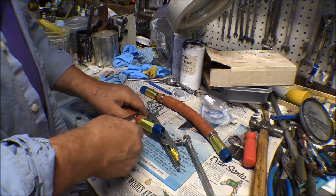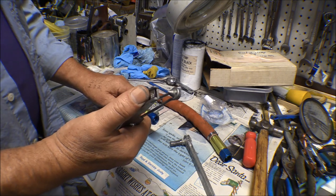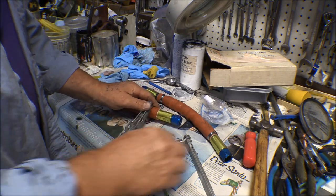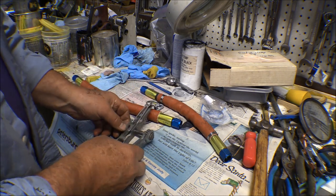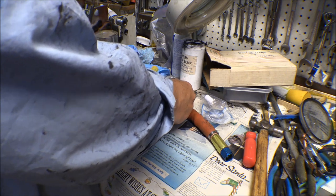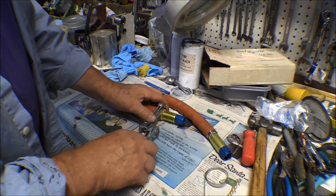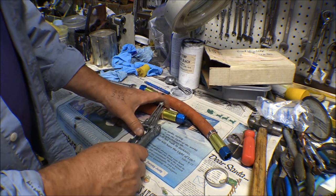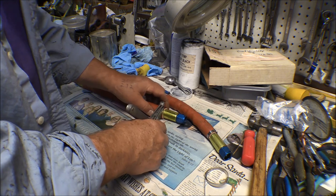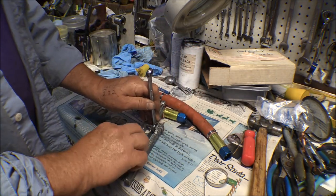It's kind of an all-purpose clamp. The tool has a little notch in it right on the end — you just slide that tool in there and it brings that clamp on the band to a stop. Then there's a ratchet with a slot that slides through the hole here and slides over that band. You just hold the tool and take the ratchet and it pulls that band, tightens up against here and rolls it up on that shaft coming out of the ratchet. There's a lot of spring in that band when you go to tighten it up, and this ratchet is kind of a loose ratchet, so if you just let go it opens back up again. There is a hex on this and you can put a wrench on it to hold it and get more purchase on it when you back up on the ratchet.